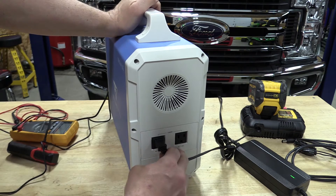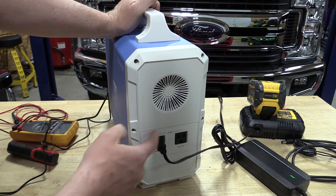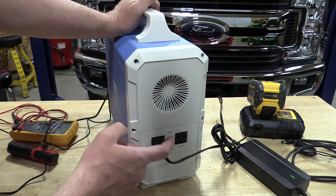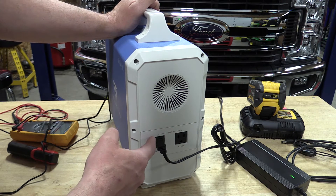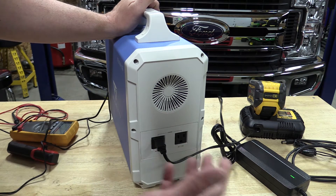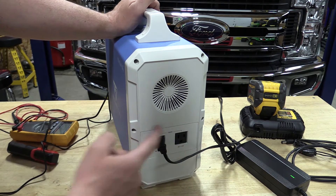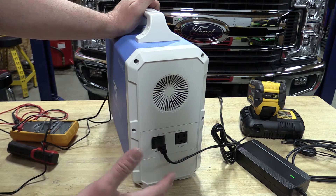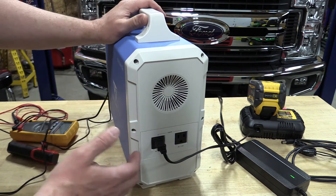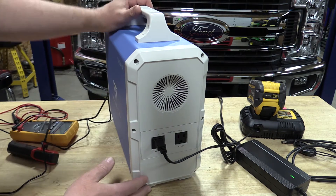Looking at the back, there are only two AC plugs here. I'll put a link in the description for a way to expand that. But with a 1,000-watt maximum, you're not plugging a ton of things into it. I've seen videos of people putting circular saws into the back — that's fine to turn on and let run, but the moment you touch it to wood and start actually cutting, you'll trip this unit. So this is for camping, small items, chargers, and power outage situations. The fan input is in the back and the fan output comes out the front.